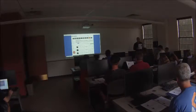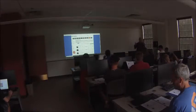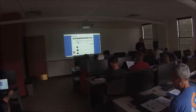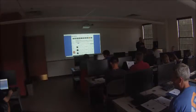The omni-wheel has a traction surface made up of rollers that are going basically sideways to what the wheel would normally drive. And those rollers just free spin, right? You can just sit there and spin them. Those rollers are made of a fairly grippy rubber, and that allows the wheel to have traction in the forward direction, but they can move freely side to side.